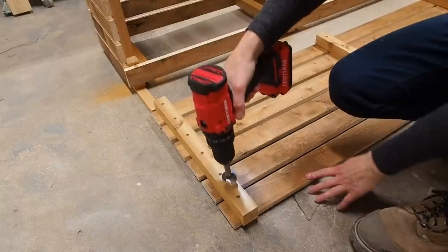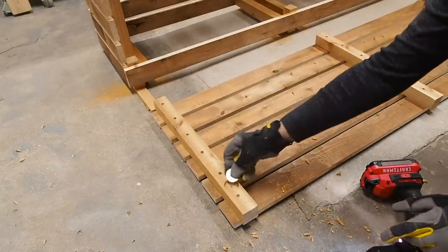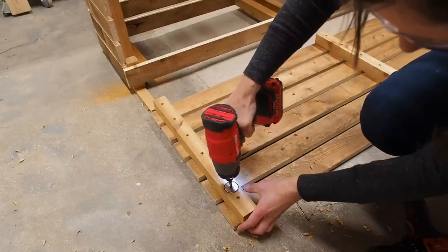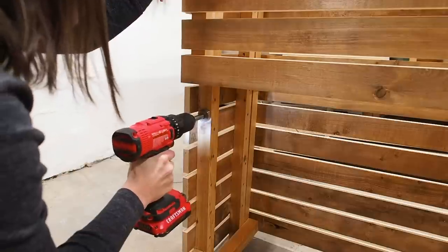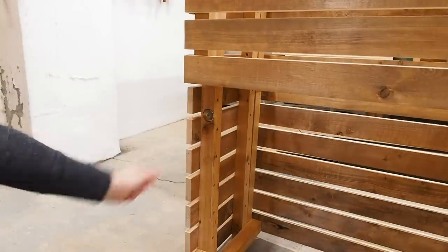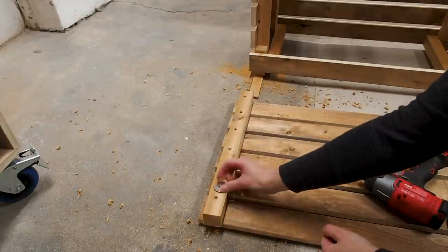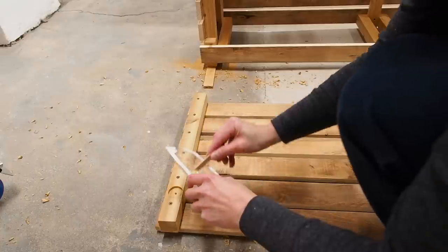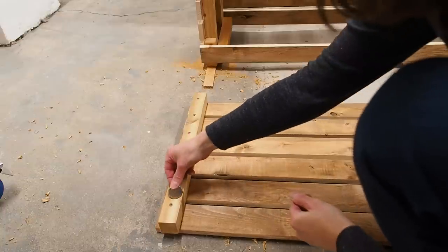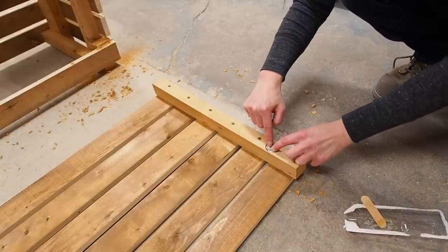To hold the door in place, I'm going to use rare earth magnets, which are super strong. I was pretty excited when I found these ones that can be screwed on instead of glued on. All I have to do is screw a pair onto the door and another pair onto the frame — and voila! Well, that is until I realized this wouldn't actually work. Because of the polarity of the magnets, one of them needs to be flipped around to face the other way, which means it can't be screwed down. So I mixed up some 5 minute epoxy and used that to secure the magnets into the frame, face down.